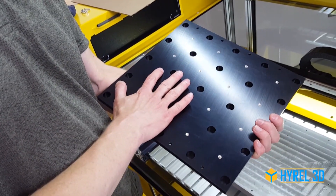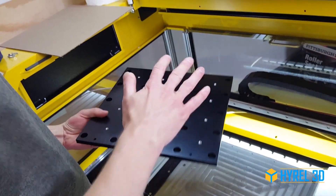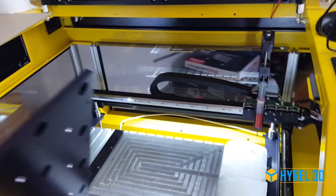To keep these magnets inside, we're going to use a high-temperature silicone. One problem we found when we were making our prototype is each time the amount was a little different and made a really big mess, so what we're going to do instead is use our SDS head filled with silicone to dispense the right amount of material.